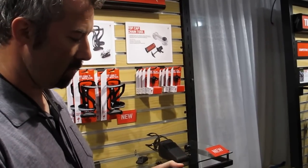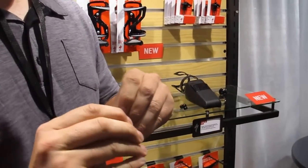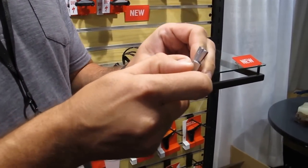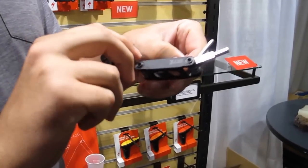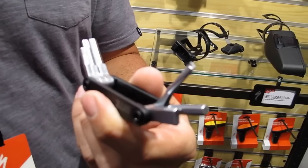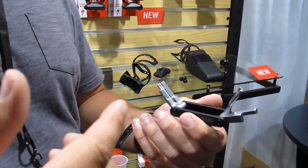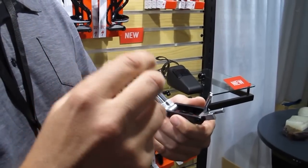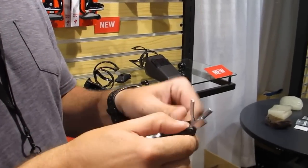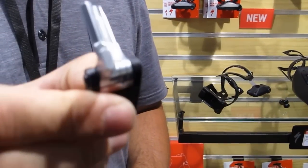Nice positive snap. You look at this tool and think it's a pretty basic tool — but no, it's not. In order to make it small enough, we had to laser cut each of these little bits out of plate. After they were cut, we had to find a way to put the hex on it so it would never strip out a bolt. We have a lathe that spins at 10,000 RPM and a secondary cutter also spinning at 10,000 RPM, perfectly timed to cut each of these flats. So we have really tight control on the whole thing.